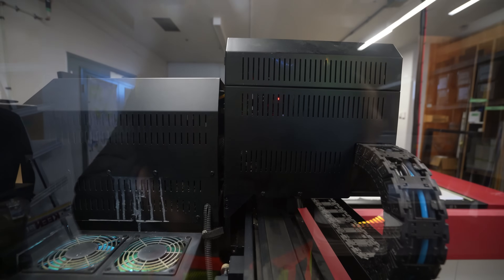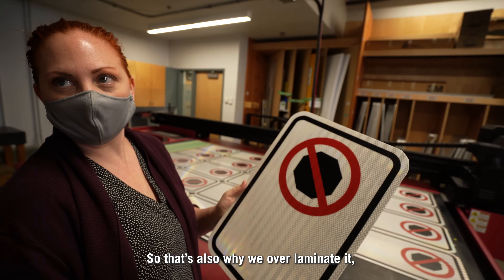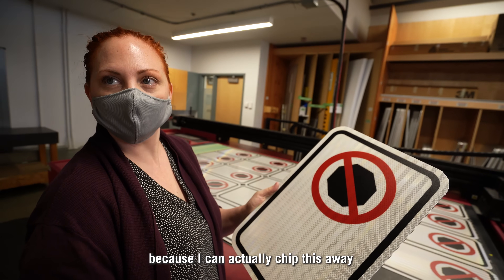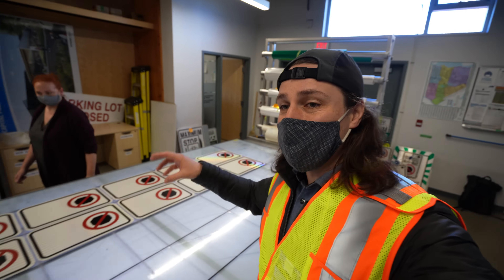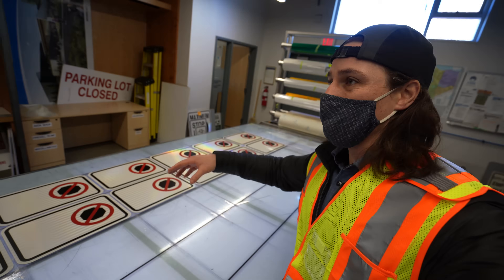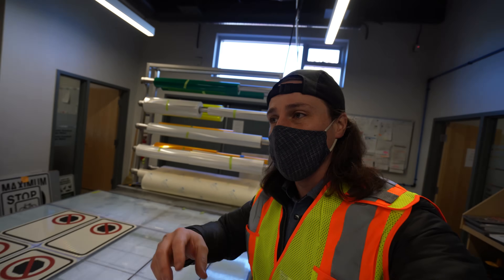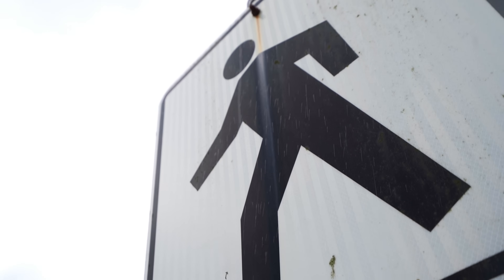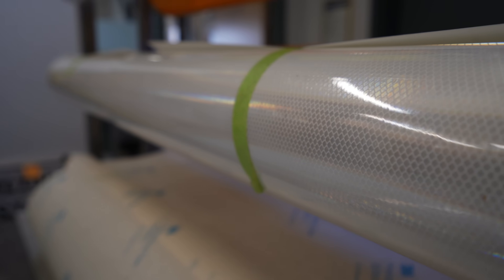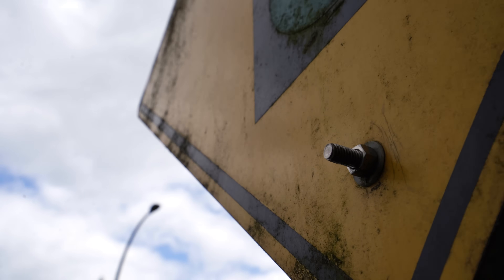The printing is done. The signs are completely dry, but the UV ink is brittle, so that's also why we overlaminate it — because I could actually chip this away with my finger right now. Street signs are provincially legislated to be reflective. Parking signs don't have to be as reflective as the high-speed signs like speed limit signs. This is the speed limit reflectivity level, then parking signs, and then the least reflective — but it is still reflective material.